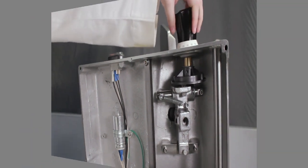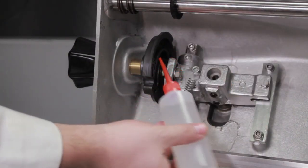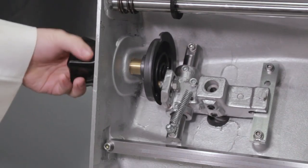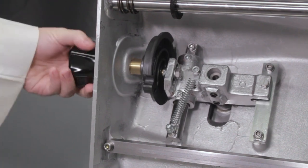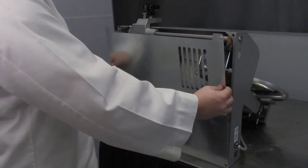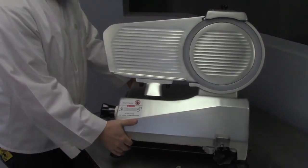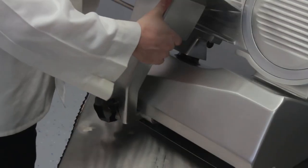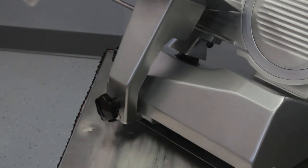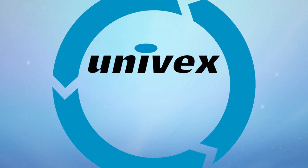On a monthly basis, a few drops of mineral oil should also be applied to the black cam. Turn the thickness control dial back and forth to distribute the oil. Replace the bottom panel, secure it with the screws, and then reattach the feet. Carefully return the slicer to its normal position. Reattach the carriage and tighten the knob. The unit is now ready for operation. Thanks for watching the Univex slicer training video.